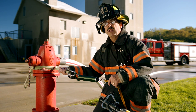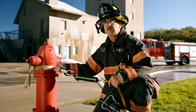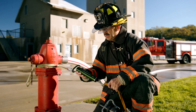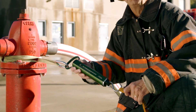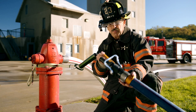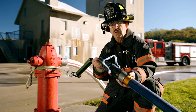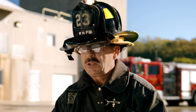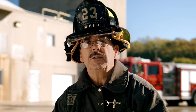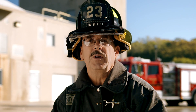The fire hydrant here simulates a solid anchor — could be a street sign or post — connected via a piece of webbing or rope to a fish scale that goes to 150 pounds, available at any sporting goods store, and one more piece of short webbing as a choker going back to the coupling behind the nozzle. This device gives you the opportunity to objectively measure nozzle reaction for a variety of different nozzles.